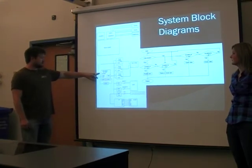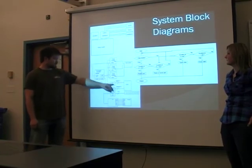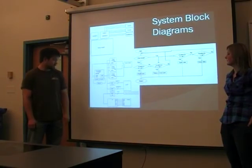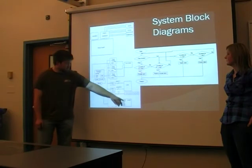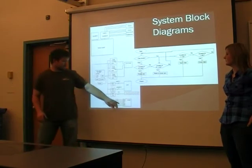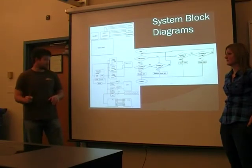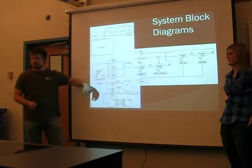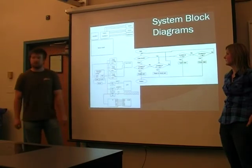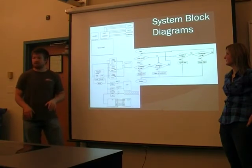This is what we did in our actual hardware. We've got our MicroBlaze, the usual suspects — the GPIO for the LCD and the LEDs. We use an SPI to control the joystick with dual data lines. The joystick works by sending bytes to it; there's actually a microcontroller on the joystick that takes information from the potentiometers for the movement of the joystick. As you send bits in, it sends back bits at the same time. We also have three timer counters that control our PWMs for all three servos, so each one has its own independent PWM and we can control them at different rates simultaneously.